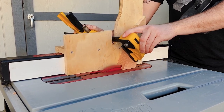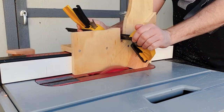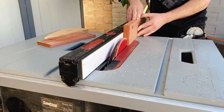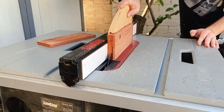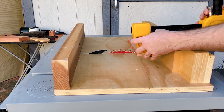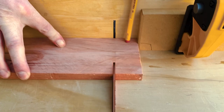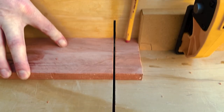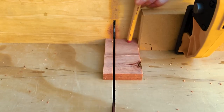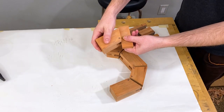The handle joints need to be strengthened with splines, so I cut a 1/2 inch groove with a dado stack and a homemade tenoning jig. Then I resawed the remaining piece of 2x4 to 9/16 thick, and put it on the crosscut sled with a stop block to cut the splines. The splines were intentionally made too thick, so I had to go to the hand plane.